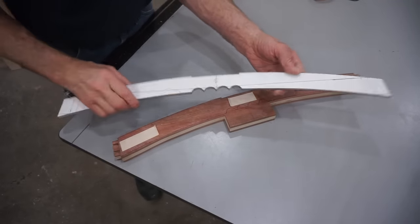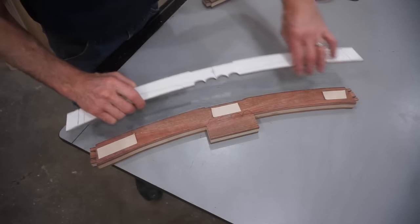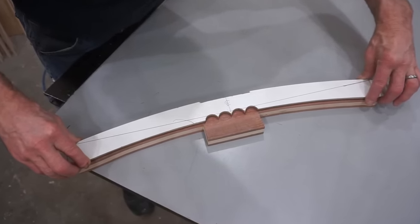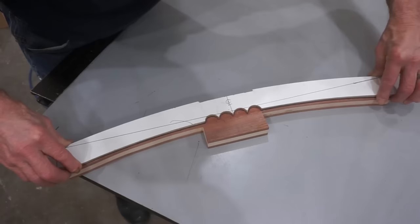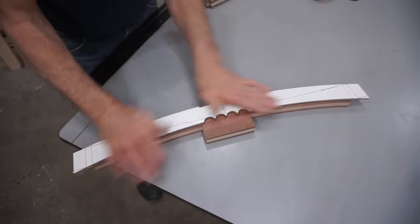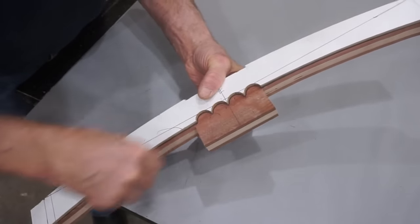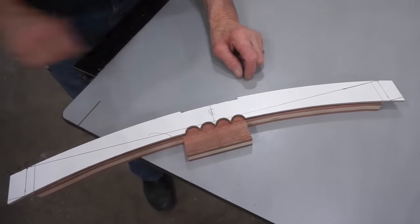And the first part of that answer is that I want the template stuck to the workpiece before I make those notches. And I've got three pieces of spec tape there, and I'll just line up the template to the magic marker marks. Little Sharpie marks made earlier. I'm lining up the center mark and the Sharpie marks here carefully, like so. That is going to do it. And if you look close, you can see that little Sharpie mark along there and notice that there's margin of extra wood all around the profile of the pattern, and then a big lug here for the pistol grip.